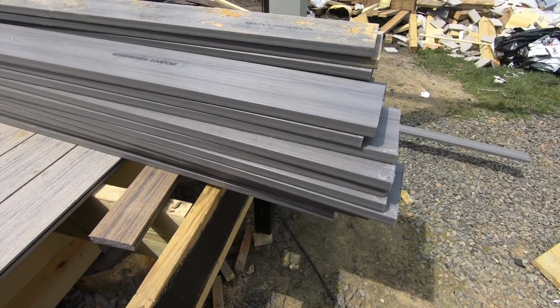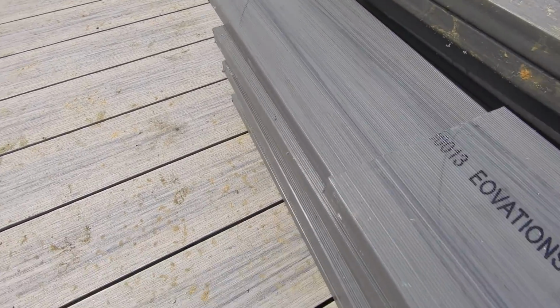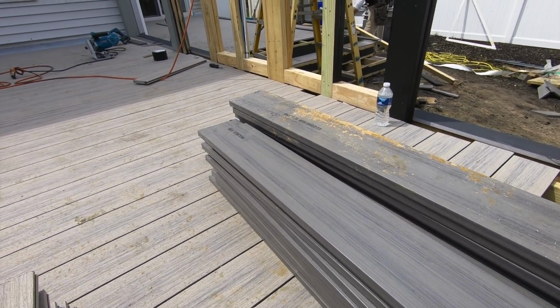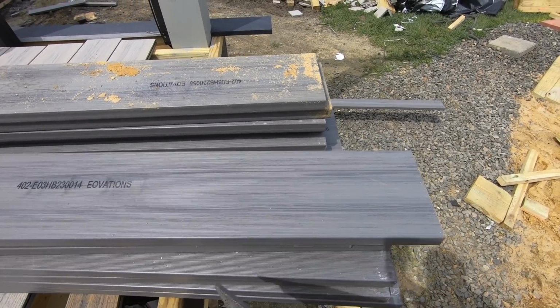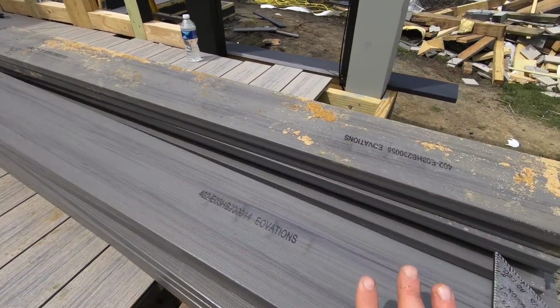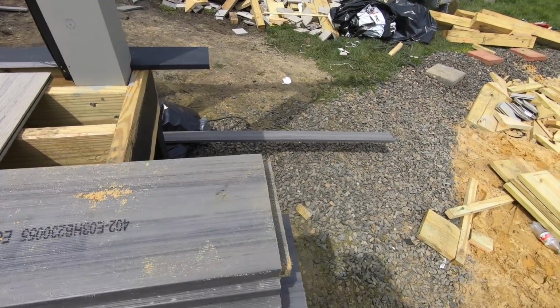That's planning, baby. So what I've done, here are the 24 boards cut down to 52 inches. I have left a long tail on our line to demarcate which is the cut side with the miter saw, so that is nice and square. And now this side is going to be where the miter is. I also have them facing all the same direction, so all the good cuts are down there. They're all upside down, so I can just go like this.